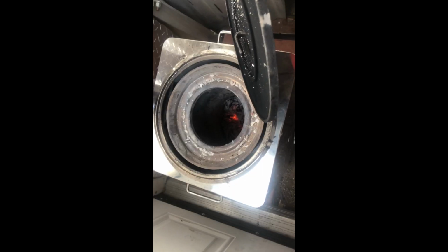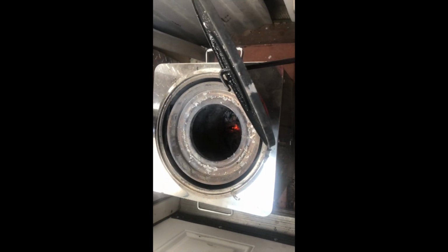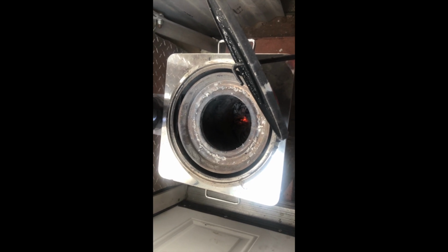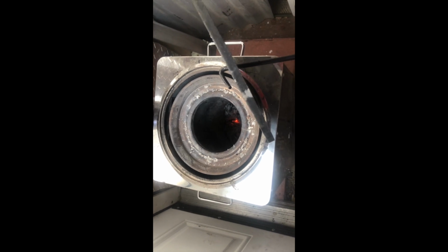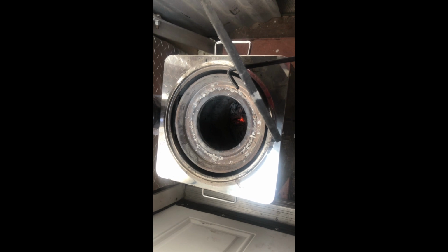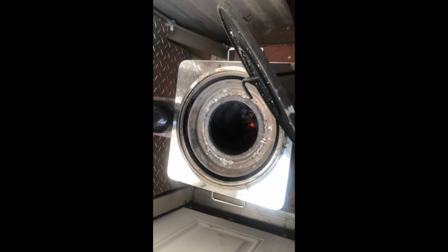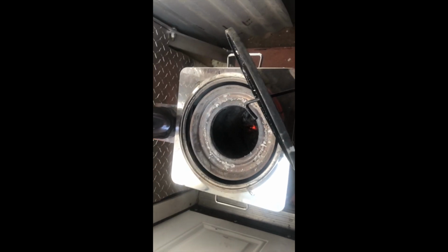This stove also does a great job of demonstrating auto combustion. The dark smoke is replaced by clear smoke when I open it as it cools down. My suspicion is the dark smoke is related to that gas. I had mentioned the gasification process, producing the gas and then instantly burning it. So you'll see that it burns black when it's in this first chamber, but actually when it goes out the exhaust, it's clear again, because that also gets burned in the process. But when you open it up, a little bit of it obviously gets out.